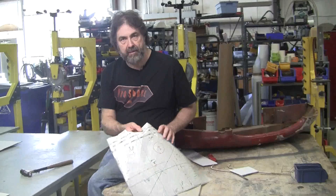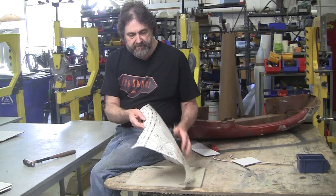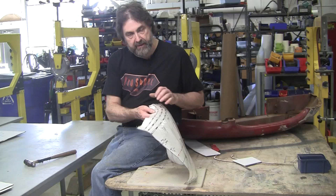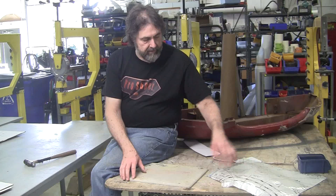Now, in the process of making their panel, they came up with the problem of how to put this curl in. Well, as far as the complexity of this E-type bonnet, it's this opening right here, this grill opening with this curl, which has initially a shrink, and then to get it over center, there's an actual stretch on this edge. So this has a lot of complexity. This is a tight little radius here, and with the flexible shape pattern, they were actually able to make it pretty easily. As far as the volume of shape, it's not that big a volume, so they did some shrinking, I think 4 or 5 shrinks, and they popped up the shape.